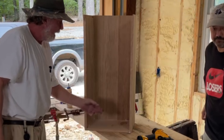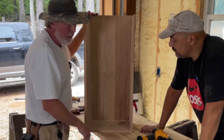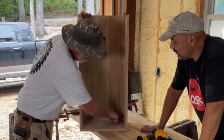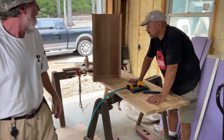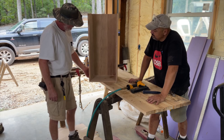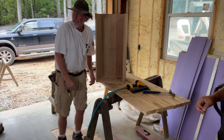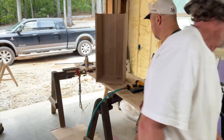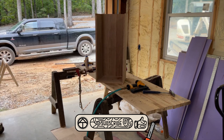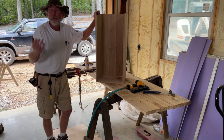That's how easy it is to assemble your boxes. We're going to let the glue dry off a little, come back with a knife — boop boop — cut them out. This is a beautiful cabinet. There's a kitchen cabinet — no going to Walmart or Lowe's or wherever you buy cabinets. It's substantial. Make sure your wall is strong because these are solid oak cabinets without frames and they're actually really heavy. Jay is my glue cutter. That's how simple and easy it is to make your boxes for your kitchen cabinets, bookshelves — anything you want. Make your cut sheet, you're making the wood, and it doesn't have to be standard — it could be custom.